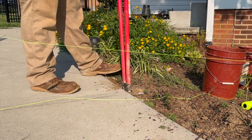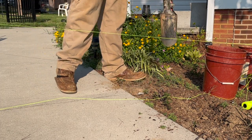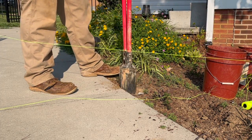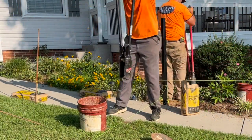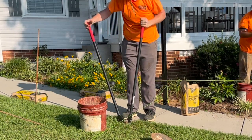In this video we're starting with gate posts, but you can also start with an end or corner post. Dig the hole for the post — we recommend a minimum of a 6-inch diameter hole. Make sure that your holes are deep enough to extend below the frost line for your area.